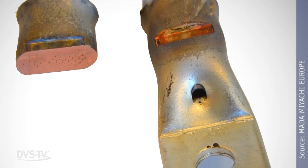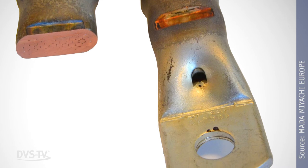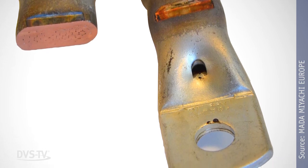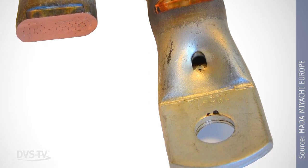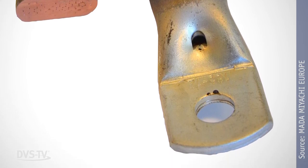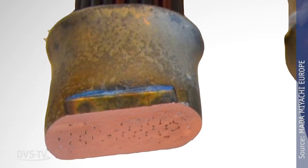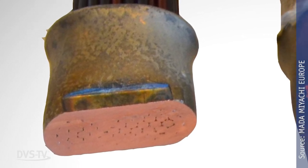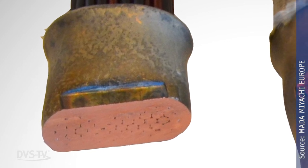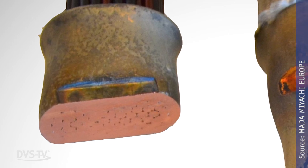With the hot crimping system, there is no metal stripping or removal, guaranteeing maximum strength. A unique weld-to-displacement feature allows the equipment to be programmed to reach the specified compression, after which the current flow and the heating are switched off. This compensates for part-to-part variation and lets users program a parameter which is closely related to the joint quality.